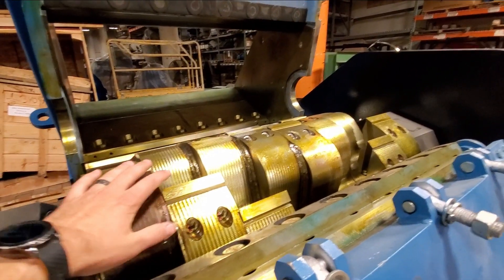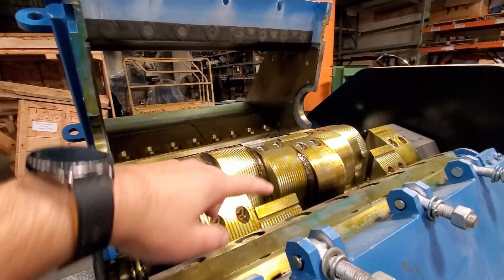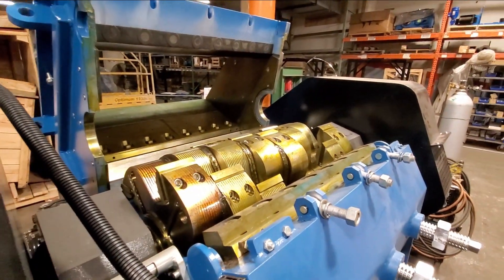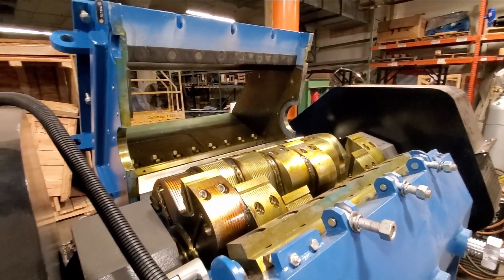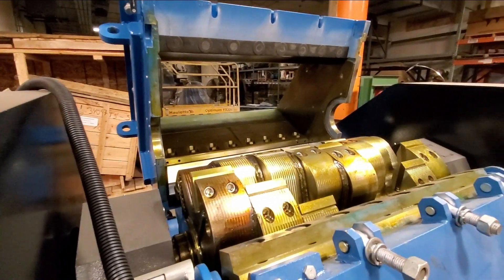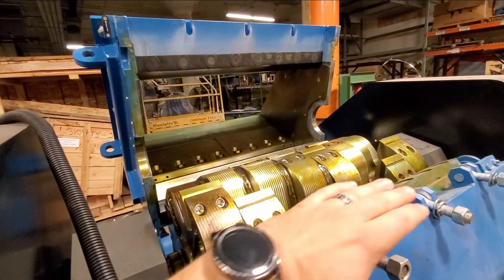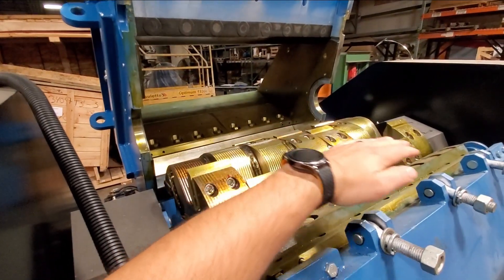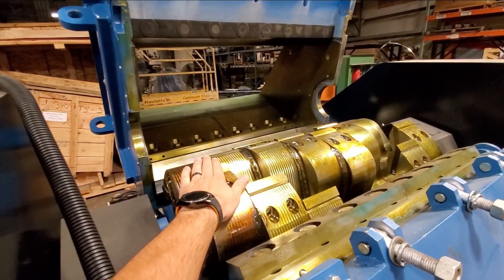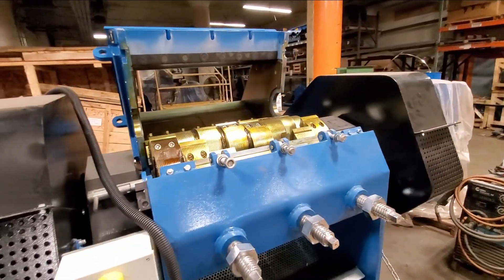As these knives cut and finish with one section, the next row is right behind that and starts all over again — five rows of blades. So you have a lot more power concentrated at one tooth. If you have one blade going all the way across, that stopping power of the complete blade hitting the bed blade creates a lot more resistance. Whereas here, there's less resistance — it's just cutting at one point at a time. So you can do a lot more throughput with a lot less horsepower.